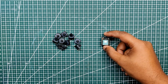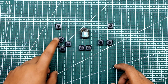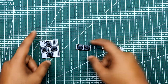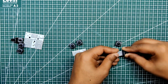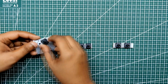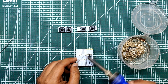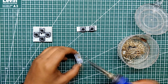We begin building the button board by first gathering all the necessary parts, including 12 by 12 mm tactile switches and 3 perf boards that will be used to create distinct switch assembly parts, each of which will include a set of directional keys, A-B keys, and start and stop keys. To hold the buttons in their place, we first put them on the perf board and solder their pads with the soldering iron. Next, using a silver copper wire that can be recovered from through-hole components like LEDs and resistors, we link the ground pin of each button to one another.